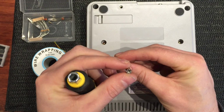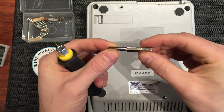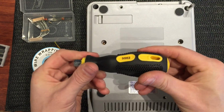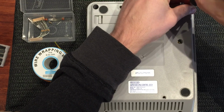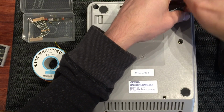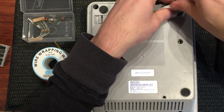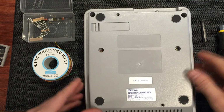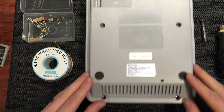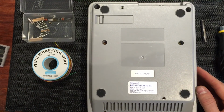which is available off the internet. I'll put a link below where you can buy this from. And we need a 4.5mm, that's for Super Nintendo. Grab yourself a handle. You can use a normal screwdriver handle, and pull these security screws out. So I'll just go ahead and do that, and I'll come back in a sec. For your reference, there's 6 screws: 1, 2, 3, 4, 5, 6. Pull those out and we'll flip it back over.